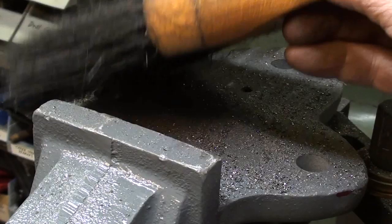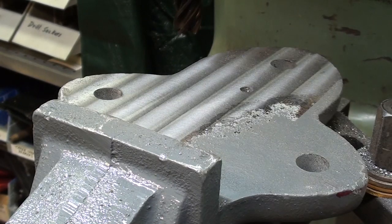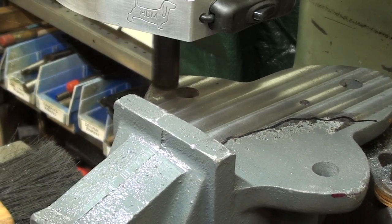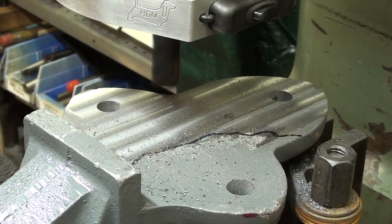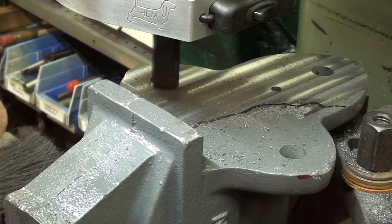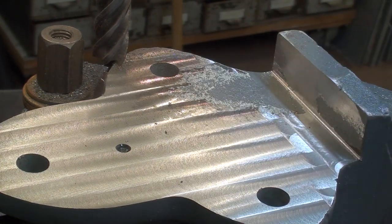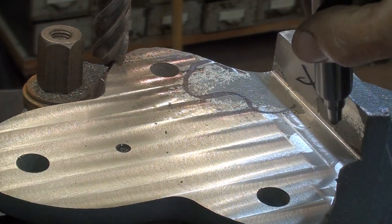Wow, did that make a difference! I really don't know whether it's the sharp cutter or the extra clamping, but probably both contributed to my newfound success. You can see up to this point it's all machined, and here is the low spot in this area that hasn't cleaned up yet. But no problem — I'm getting there. I've about lost the edge on that dull end mill — it was kind of dull to start with, and it's pretty much shot now. Can you see the pattern of what I have removed so far? Probably only 10-12 thousandths removed at this point.